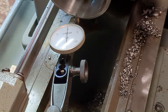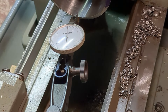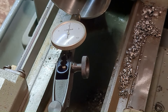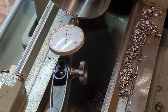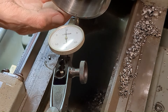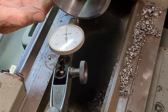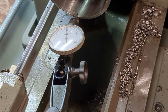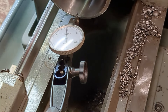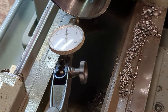Well, that's about the same as before — I'd say that's around about 2 tenths. Let's just try it slowly under power. That looks to me like about 3 tenths, possibly slightly more than before. The reassuring thing is that the low spot is again in the same position, with the key at the bottom. Instead of measuring 2 tenths I'm measuring about 3 tenths, but who knows whether that's just repeatability in taking it on and putting it back on again. Anyway, I'm going to assume that's as good as I'm going to get it and proceed with my original plan of modifying the inner sleeve.